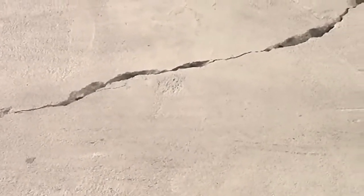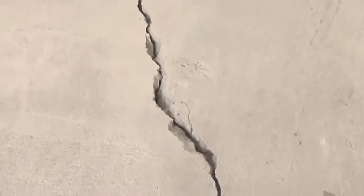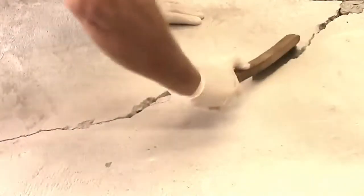The following will perform professional crack repairs utilizing structural injection techniques on this cracked concrete slab. Clean the crack using a wire brush, vigorously cleaning the concrete surface surrounding the crack so the crack is not plugged with debris.